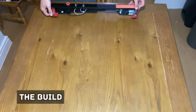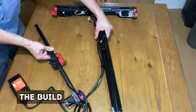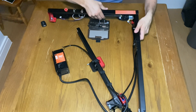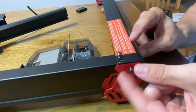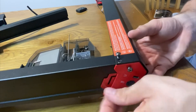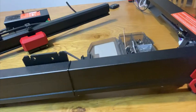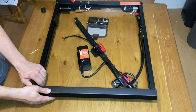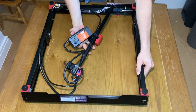This is the front section with the control buttons and motherboard. The side, center and the laser unit are already wired together. Once the front and the side are clicked together there are three screws to hold it in place. Instead of using my own tools I used the ones provided, to ensure the kit included all the tools required. This cable tie needed to be removed as it was just there while the machine was in transit. Three screws are used on each corner before the machine is turned over so the cable can be connected to the motor.